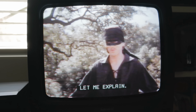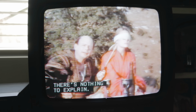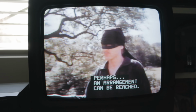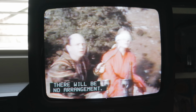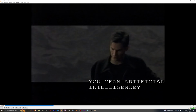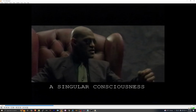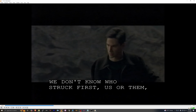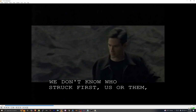When the VCR is playing a tape with closed captions, it simply passes along line 21 just like any other line. It doesn't care about it, the TV does. In fact, it generally can't decode it. Now that you know all this, let's go back to the DVD it just made. It has the captions there, completely toggleable. So that means the VCR actually has a caption decoder in there, and while recording to DVD, it has to make digital caption data and put it on the DVD.